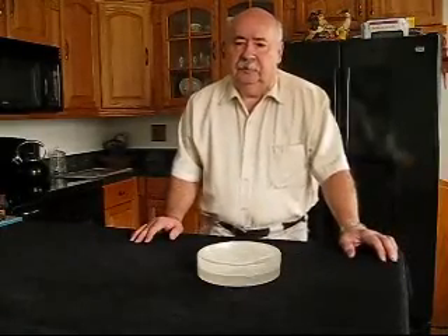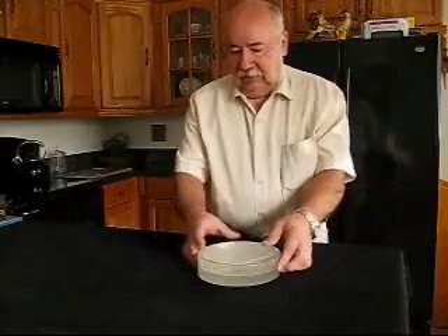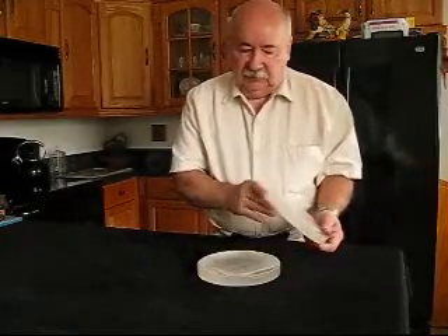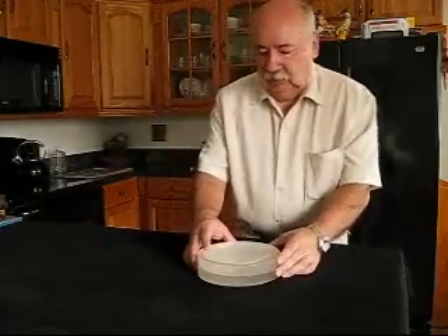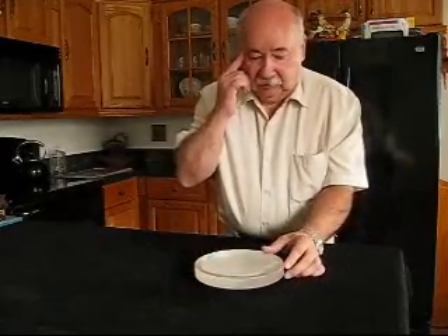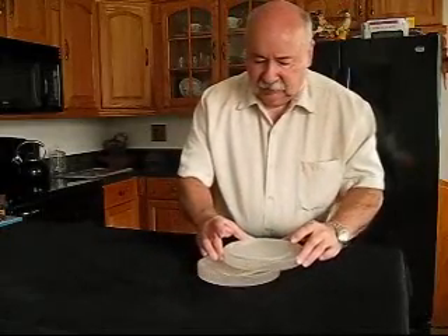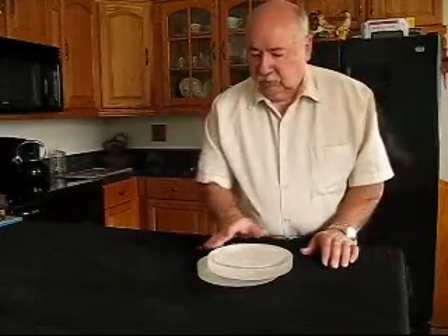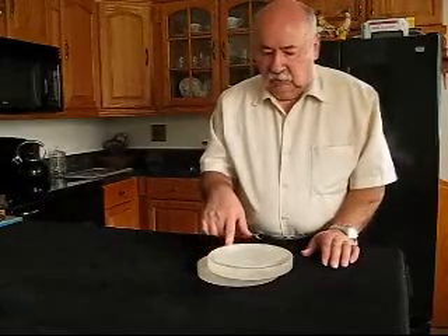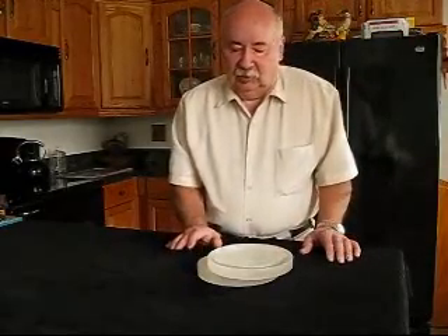Now years ago, telescope makers would get two pieces of glass, and they would throw a little bit of silicon carbide abrasive on it and some water, and then they would do a nice W stroke, overhanging your mirror on top over the edge. A lot of W stroke grinds away the center of the mirror on top and grinds away the edges of the tool, and generates the curve that way. That's a very messy process and best done outside and not on your wife's kitchen countertop.